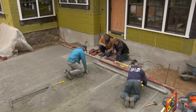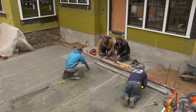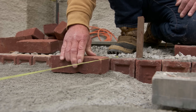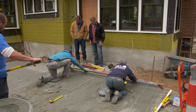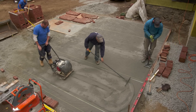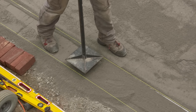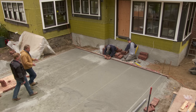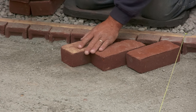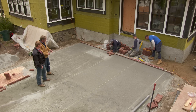You've got the rails in there already, the metal pipe, and the metal screed right here. So we're just gonna take and run that screed down the rails and it'll leave us the perfect height to set the brick. We just have to put the brick in like that, give them a little tap, and we're good to go. We really put a lot of work in the base — everything is compacted, it's not gonna move, and it's up to the perfect grade. So we just start dropping the pavers in.